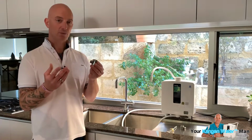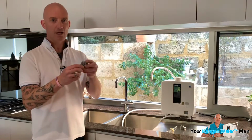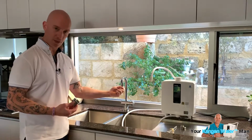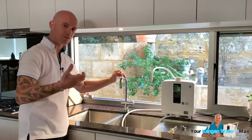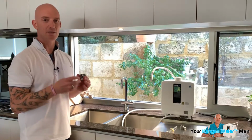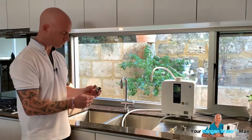It comes standard with the K8. You also get a big white ugly thing that looks like a camera. The metallic diverter is the best way to go. Now, with this, what you do is you unscrew the end of these. It's usually hand tight, but if it's not, then you're probably going to have to get some grips. However, I know that this is too small. This is actually about a 20 mil, and I need a 22 mil to go into the thread here.